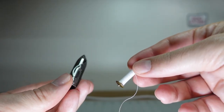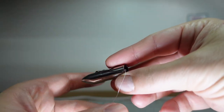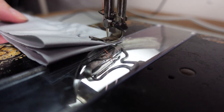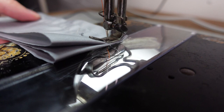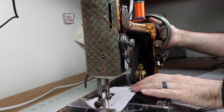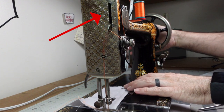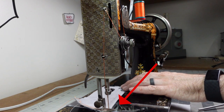They decided to spin the lower thread onto a bobbin, which could move through a loop in the upper thread to create a lock stitch. You just place a bobbin in the shuttle and it would oscillate as the upper thread came down through a specially designed needle with a hole in the end of it. You can see the shuttle pick up the thread from the needle — once it passes through the thread from the needle, that creates the lock stitch. But now you have a loop of thread under the fabric, and that loop needs to be taken up after the shuttle passes by. Maybe we should invent a lever to do that — how about a take-up lever? See how it moves up just as the shuttle passes by the needle. It's important that the shuttle and the needle pass each other at the correct time — we'll talk more about that in a later video.